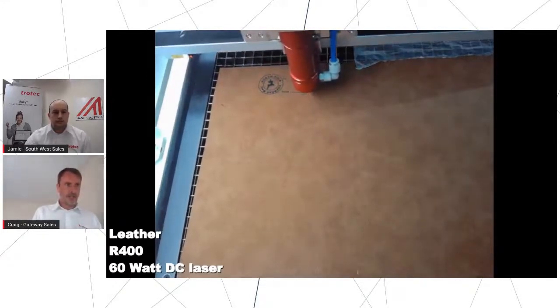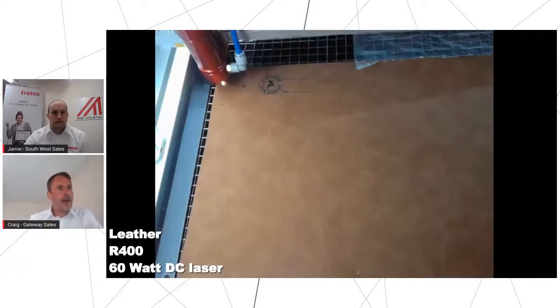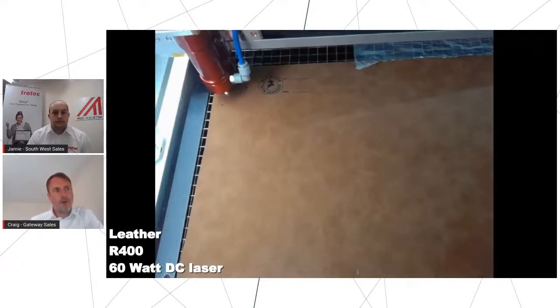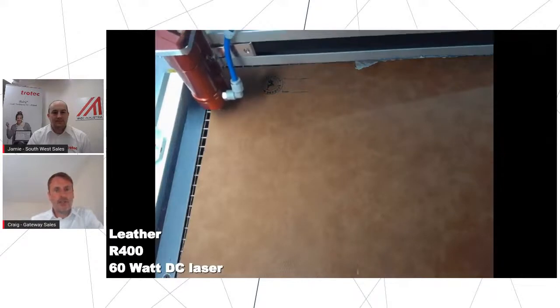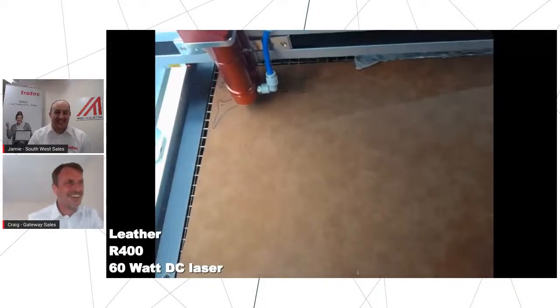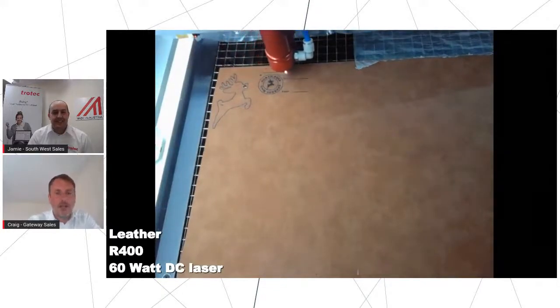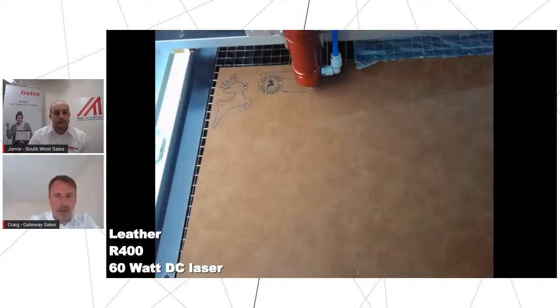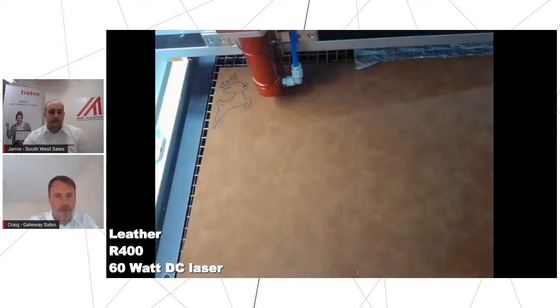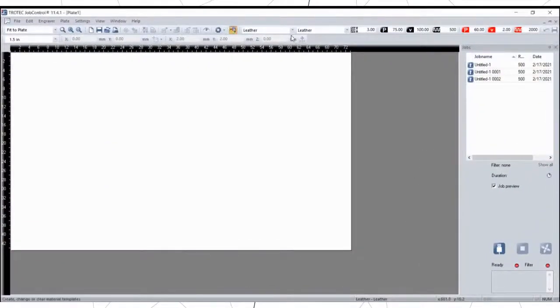Again this is a 60-watt R400 we're using. We've raster engraved for the text and the image there, and as you can see that was just a vector engraved using a Z-offset for the circles around the text. A good tip for using a glass tube is using the correction value — I'll just share my screen to show you that we can have an effect on the correction in our settings on each color. So in each color here we've got the vector engrave, the raster engrave, and the cuts.